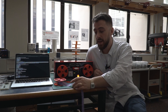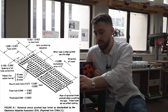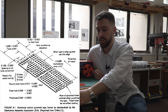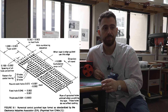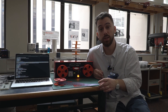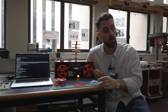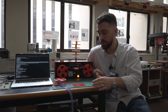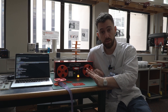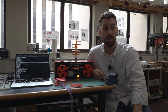This is an 8-bit ASCII machine with one index hole. It follows the standard that I'm placing on the screen right now, and I did want to keep it in that standard in case I ever ran into another type of reader or wanted to write code for another machine from that era. Regardless, this machine took me about a month to build. The original creator David Hansel had it in a much more rudimentary form, albeit extremely functional, and his works with a very high rate of read accuracy.